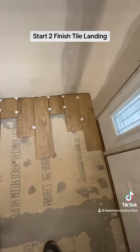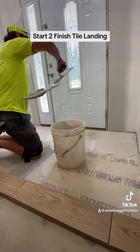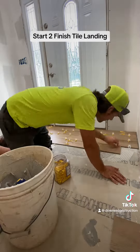Next, it's time to lay the tile out. We're doing full tile, two-thirds of a tile, one-third of a tile pattern. We lay out the entire job dry, see how it fits, make sure the homeowner approves, and then we lay out our wood grain tile.